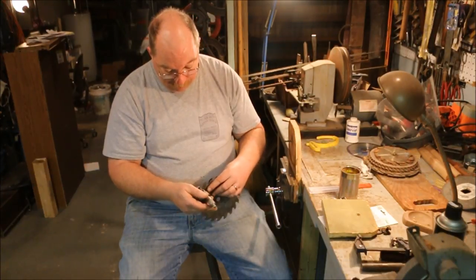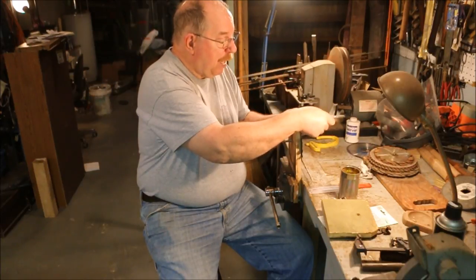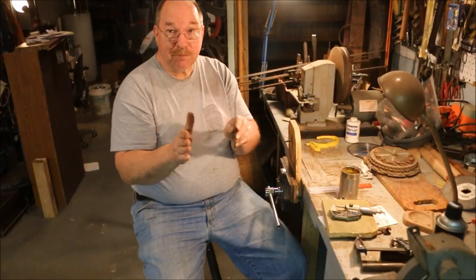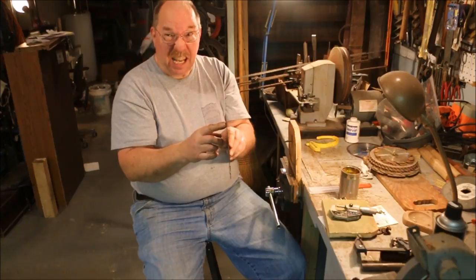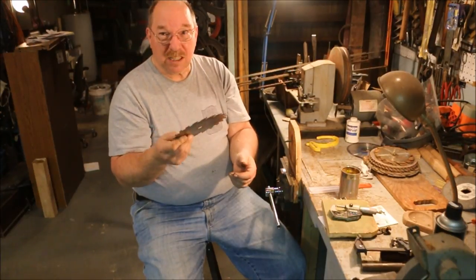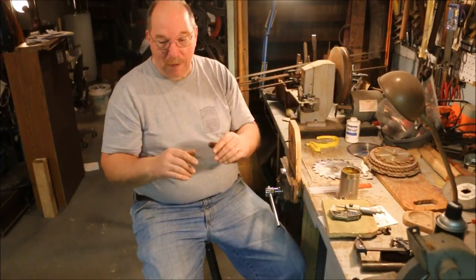The barrel, which relies on a good old Archimedean screw, is still just fine. Out here at the tip, this carbide bit is 94 thousandths thick. Down here at the bottom — look at that — it's 87 thousandths thick. So this tooth is keystone shaped, it's wider at the top than it is at the bottom. That gives it basically the set. So if these two edges up here are sharp, I shouldn't burn anymore. We'll test that to see — at this point that is a theory, we don't have any proof.